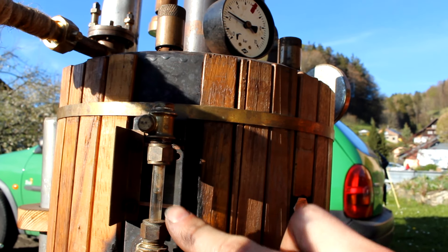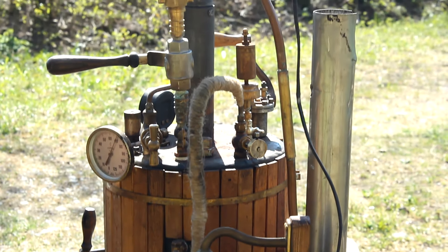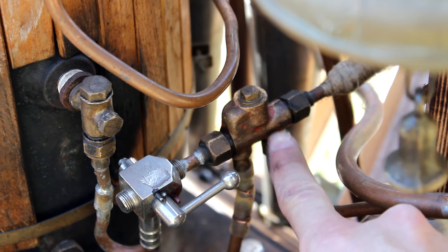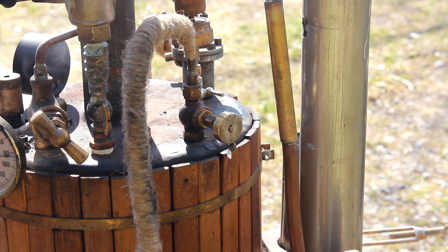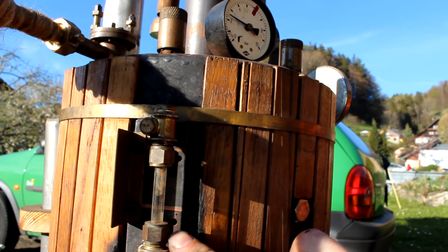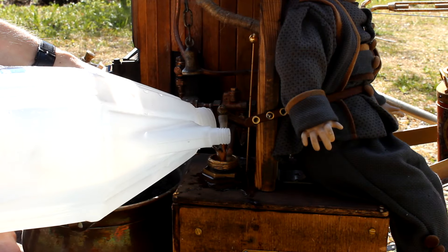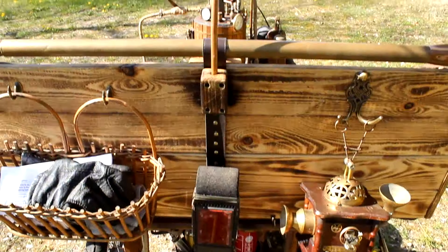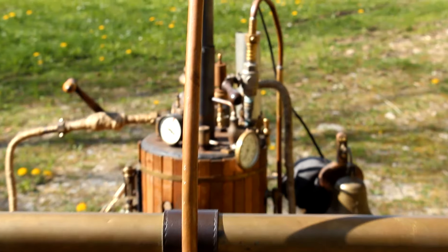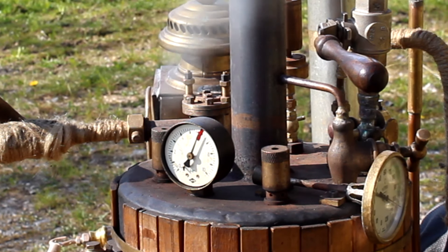From time to time we have to check if the fire is burning well and feed a few pieces of coal into the firebox. Using steam means using water, which we must also refill from time to time. Leila is equipped with a so-called injector, which uses very special nozzles and condensing steam to push cold water against the boiler pressure and feed it without any moving parts. Just open the steam injector valve and it should do the job. The tank holds about five liters of cold water, and the level gauge I made from a float and a brass rod. But if you pump cold water into a hot boiler it will cool down and reduce pressure until the new water heats up again. So be careful not to feed too much water at one time and always keep the fire burning as hot as you can.